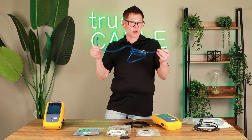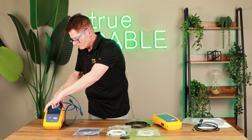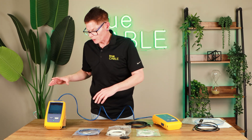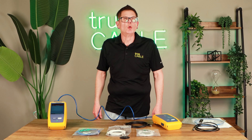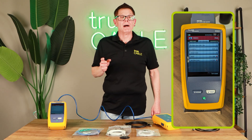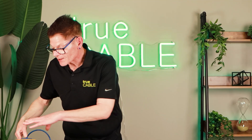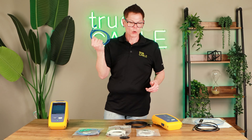Let's do another patch cord. 75% of the patch cords out there are bad and we're about to find out. This one failed minus 11 dB on crosstalk and also minus 5.9 dB on return loss — those are the two parameters measured in a patch cord test. This one's so bad it might be usable for — anybody need a clothesline? That's just horrible.